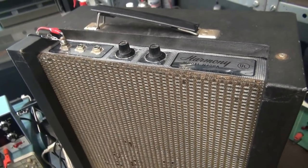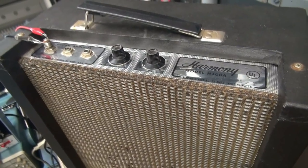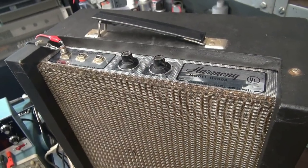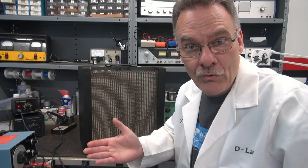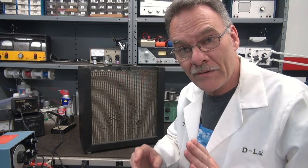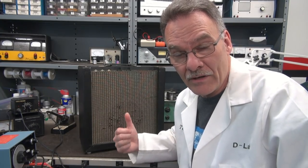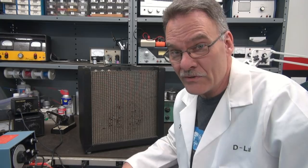This video is just to show you how easy it is to put in a standard power transformer rather than try to do a science experiment with isolation transformers, bridge rectifiers, and voodoo magic. This really brought the Harmony back to life, and now it's got a new life for maybe 50 more years. This is also an upgrade — the power system that was in it before was only running at approximately 150 volts DC, and now she's up to 300, so you're going to get a lot more wattage out of this little guy with that 6AQ5. And those tubes are readily available, so this guy is good to go.